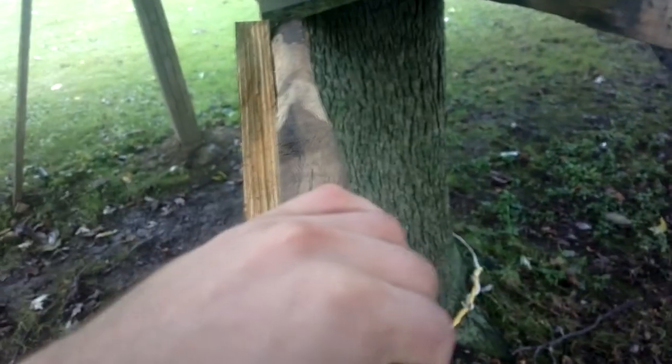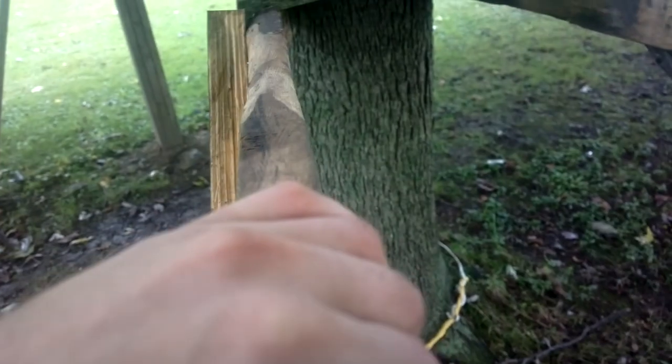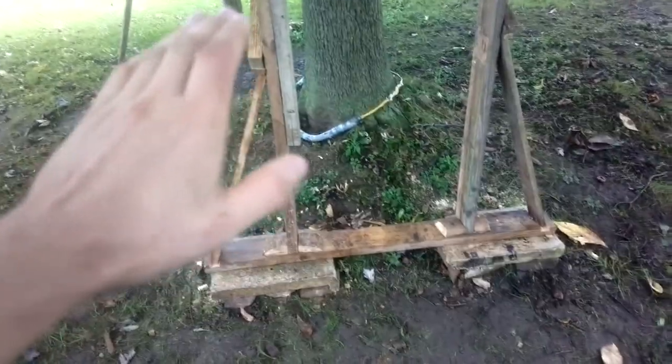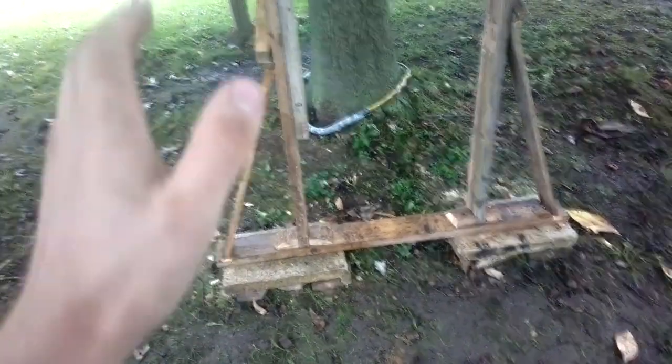But here is the weakest point, and for this reason on this side when I'm doing it, it's a little bending. I know — I don't know what you can see — for this reason I made extra support. It's still a little bit moving but it's alright, it doesn't move more than needed to break this detail. When you're doing this, the small wood blocks really don't move. It will be much stronger. Two nails, two nails — and of course in this strike it's really tough and not moving. This cut has a little edge that supports it and keeps it from sliding.